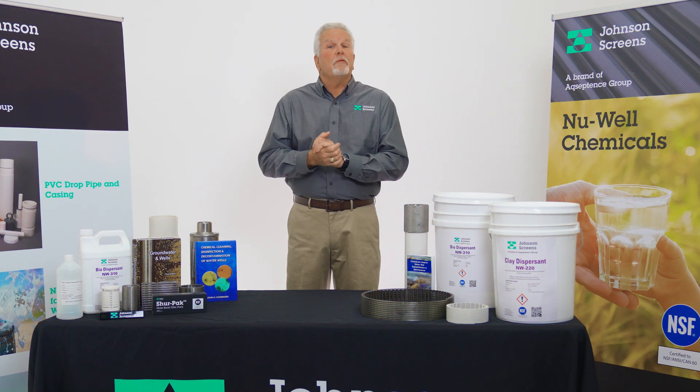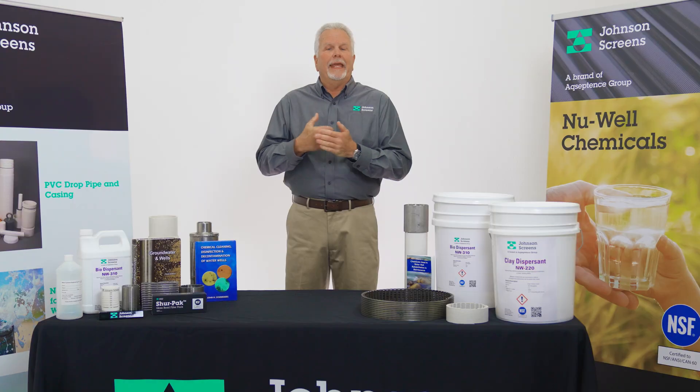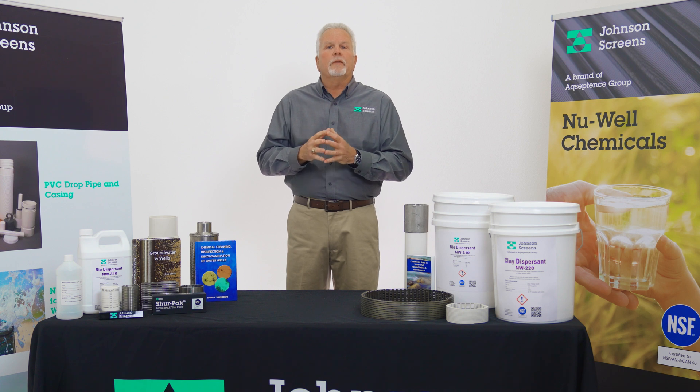Newwell 220 was the first phosphate-free alternative product to be NSF approved and be used in potable water wells. It is NSF Standard 60 approved for use in potable well systems. Newwell 220 is made of a food grade additive and is biodegradable, leaving no byproducts or residue in the well or the formation following its use. Newwell 220 has been extremely successful in the removal of bentonite drilling mud during typical new well developments and equally effective on older wells that require well redevelopment or suffer from insufficient mud removal from when they were originally drilled — such as during a drought — or those that have been impacted by sediment migration.